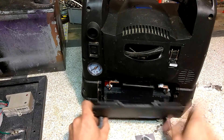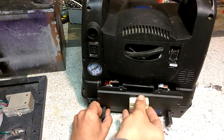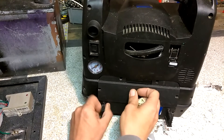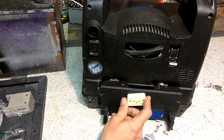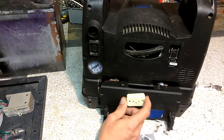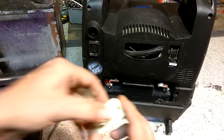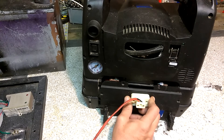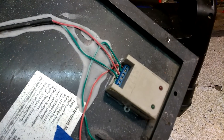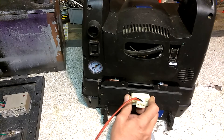After we get our back cover back on, we'll have our wires hooked up and that piece sitting right here on the back cover. That way, you just plug your solar panel into the back of it — whenever you're not using it, grab your plug, plug it into the back of the unit, and set your solar panel out in the sun. As the thing sits there, it charges up. Since we have the charge controller on the back, the battery won't overcharge itself, and it will be ready indefinitely.